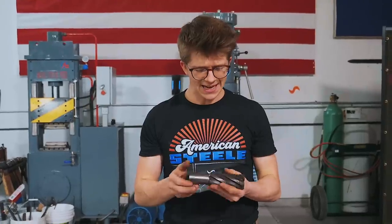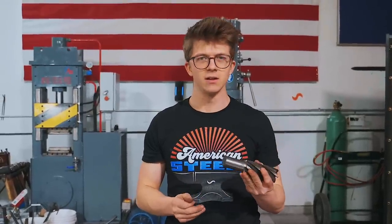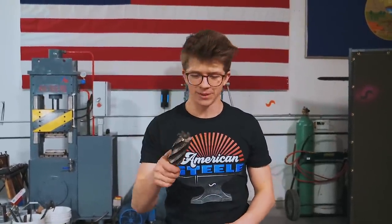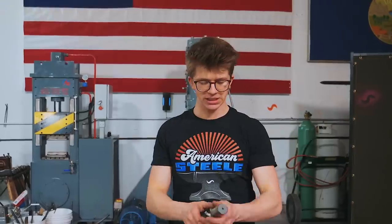Now, in my understanding, in the manufacture of steel, you've got to forge it. You know, this is steel, which is good. You've got to forge it because you've got to take that ingot that gets made and you've got to roll it down into the bars that are then going to get sold, because high-speed steel has got to get sold as a bar of steel somewhere for someone to machine into this high-speed steel cutter. But all those alloying elements, for certain, are gonna make it extremely difficult to heat treat. Might also make it very difficult to forge.